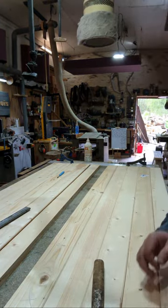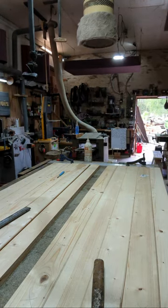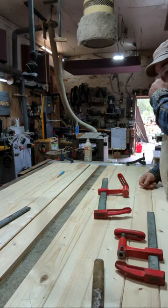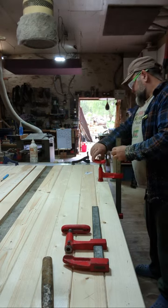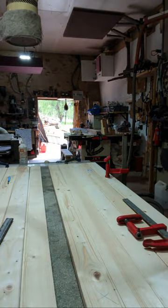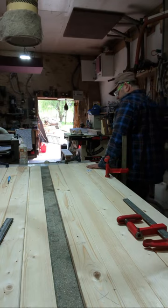Yeah, and the thing about the riving knife, most saws, when you buy a saw, the riving knife is not compatible with your blade, which seems a bit silly, really. If it's not compatible with your blade, it actually makes it dangerous, because it's a perception of false security. Your riving knife needs to be a thickness somewhere in between the kerf of the saw and the thickness of the actual blade itself. Otherwise, it won't do anything. It won't do diddly squat. No. So you get this perception of false security. And I use saws where some blades are thin kerf, some are standard kerf, about 3.2 mil, some 2.7. If your riving knife isn't the right thickness, it's not going to work.